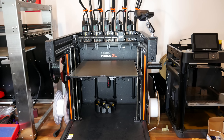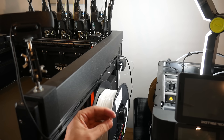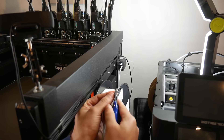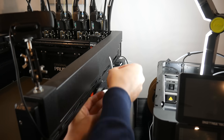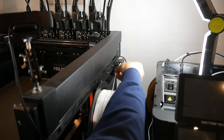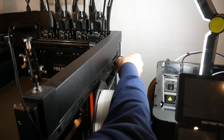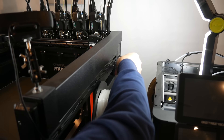I have a Prusa XL, and that gives an opportunity to look at another solution where the spools are mounted on the side of the machine — but in my opinion, this is one of the weaknesses of the XL. Let's demonstrate by loading up some TPU. Using the XL for combination prints of multi-material and flexibles is one of the reasons I wanted the machine. From the side, we have to feed filament into the first set of filament run-out sensors, which requires a bit of force — and for TPU that's a problem as it just wants to flex in your hands.